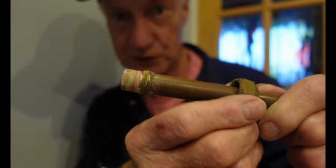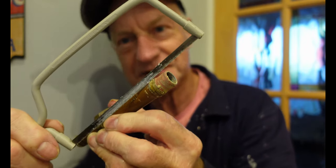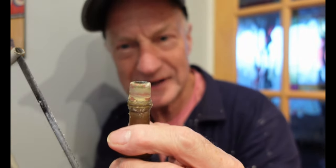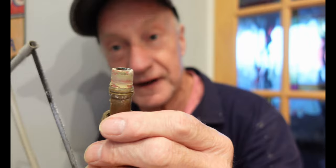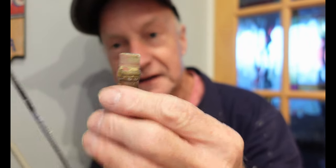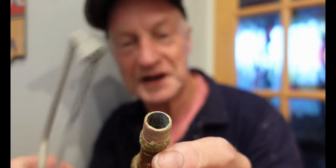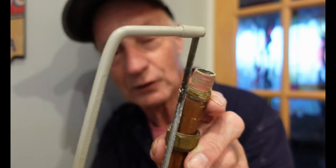Okay, second option — one of these. Yeah I know. The second option is to put a saw cut through there. Now this isn't for the faint-hearted because you know what can happen — apart from putting the saw through your little finger, that hurts, I've done it before. There may not be enough room to actually get a saw in. It might be a bit of pipe that comes out the floor and goes into the bottom of a radiator, because you might be renewing radiator valves and found that the nuts don't fit the new radiators, so you've got to change the olive and nut. And the problem is if you put the saw cut in and it goes too deep into that olive and cuts the pipe...